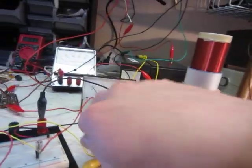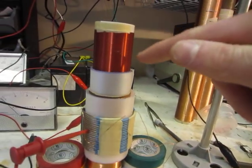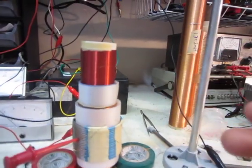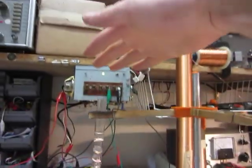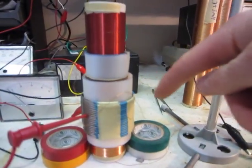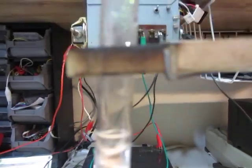They're connected in series. The bottom of the larger one is connected to the circuit, and then the end of it connects back down to the bottom of the red one. So it sort of doubles the windings, but it's still inside the magnetic field — because when the coil is all the way up here, it's not really inside the primary's magnetic field very much. At least, that's what I think.